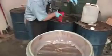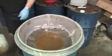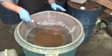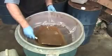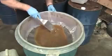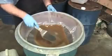We're going to take our oil and we just simply pour it through it. Now, oil coming from restaurants is really gross and nasty. As you see, there's some crusties and stuff in here. And as you notice, it doesn't like to go through this really quick. So we get ourselves a spatula with rounded corners and we just scrape back and forth to let those crusties go out. And so this oil is just going to filter through. You hear it filtering down in there. Once it's filtered, we'll take it into our lab or into our shop and we'll make biodiesel.